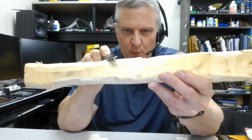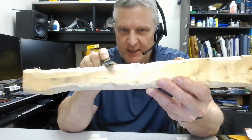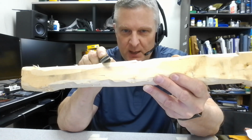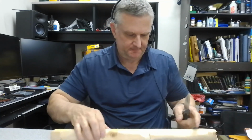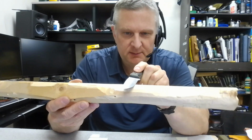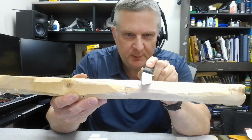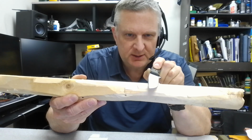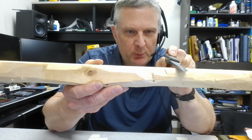And you can see how low that edge angle is, how low I'm holding that blade. Most blades, the way they're sharpened, you have to be up here before they start cutting. Let me flip it around and do the other side. Let's just verify that everything is the same. Okay, we're right here. Lay the knife down. I'm going to pick the knife up and move it. And you can see it's cutting. See how low? We're about the same spot we were on the other side.